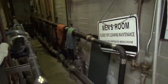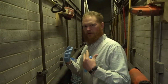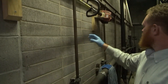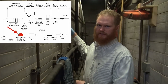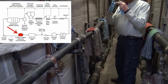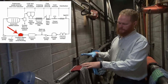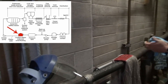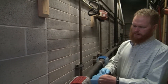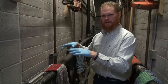What we have is two separate water systems. A lot of the rest areas — the comfort stations — are already plumbed this way. We have a water system for flushing toilets and urinals, and a separate water system that's chlorinated for hand washing and drinking fountains. So this site already has a separated plumbing system. We're going to do recycled water — we want to put water that's not potable, basically either untreated ground water or recycled water, into the non-potable system.